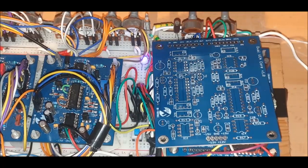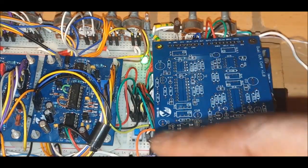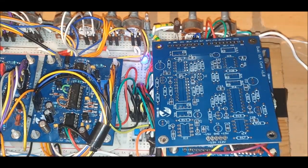So there were a few goals I wanted to achieve with this, which were basically to bring the signal to noise ratio down. I mean, it wasn't terrible, but I'm a bit of a perfectionist, and I really wanted to get this bang on. And the DC offset, which was caused by the modulation from the envelope generator. Basically, if you sent a signal through, you would get a bit of a bump every time you hit the envelope generator. It would send the signal up above the 0 line, so you'd hear that envelope click, or that little bump. So I really wanted to iron that out.